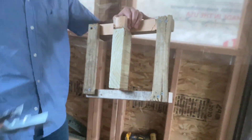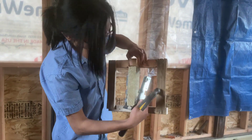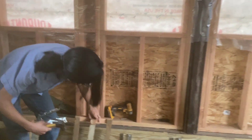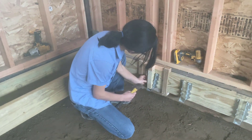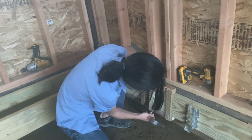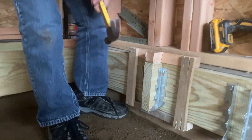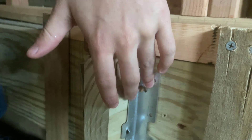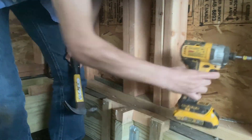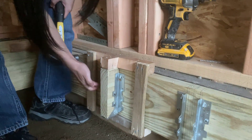One of the ways my dad tried is to create a contraption with the same shape as a 2x8, just for comparison, and the joist hanger should fit right under it. The way it's supposed to work is that it's at the right height so that when you put the joist hanger on and knock it into place — this elbow pin is knocked in to temporarily secure it — you can then take a screw or a nail. They actually recommend using a nail because the screw can break. You put it into these holes to secure the joist hanger.